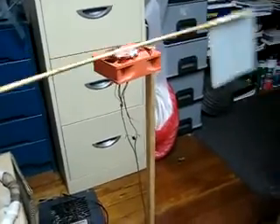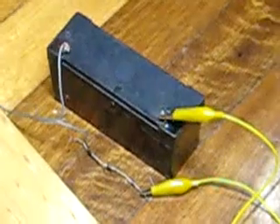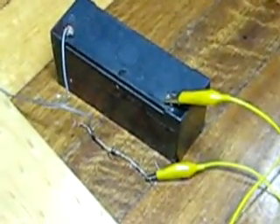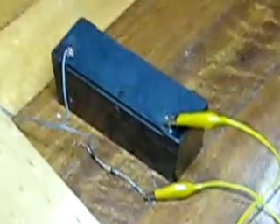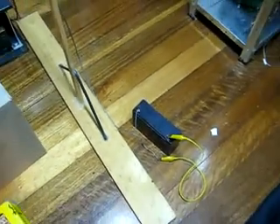To get it to go really slow - it's a 12 volt fan - what I've done down here is I've got it running from a 6 volt battery, and in series with that I've got three 1 amp diodes just to get a bit of voltage drop. And that helps regulate the speed of the fan.